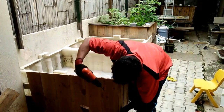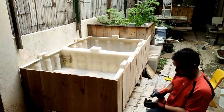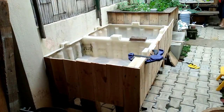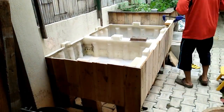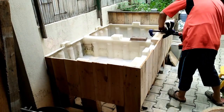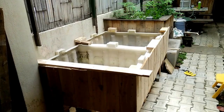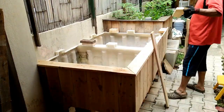Doing all of this was kind of tricky single-handedly, but somehow I managed to get the whole thing done and secure the entire frame. For the second set of screws for the top frame, I had no space, so I had to add 1-inch by 3.5-to-6-inch wooden blocks on top of the cladding — this is where the top frame is going to rest. I'm using similar wood for the top, except it's about 3 inches wide, cut to shape.